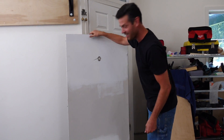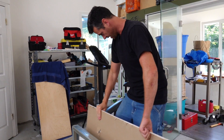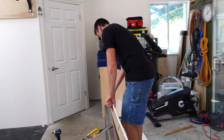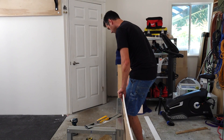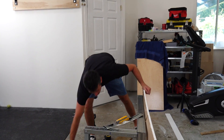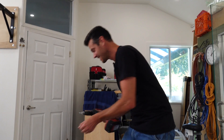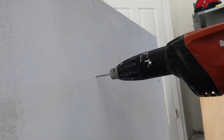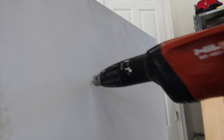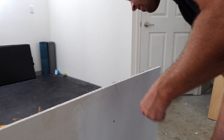You guys recognize this sheet of drywall. Let's fasten some of these so we can see they're all going to hold the drywall on — but as we've already seen, only one of them is going to do the job properly. We'll try sinking all of them. Starting with the self-tappers — there's a bit of a delay as it goes in as it rides the steel stud. What often happens is it kind of blows out the hole of the drywall, which makes it even worse. I mean, it holds — it's kind of doing its job a little bit.